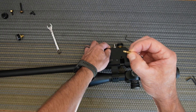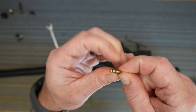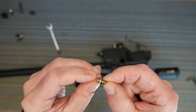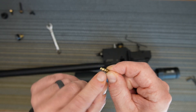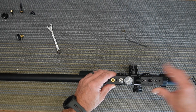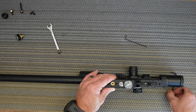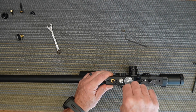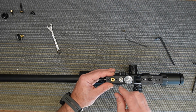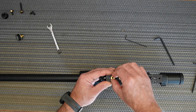This is the regulator valve right here. Those two black o-rings are responsible for most leaks. You can already see this one is separating — on Crowns these o-rings are known to go bad. Those two need to be replaced. Set the valve aside, and then I recommend getting the whole regulator base out using a 5mm Allen key — just twist it once to get it out. Be careful as you remove it because the washer stack is right underneath.